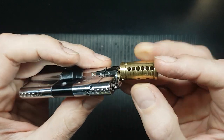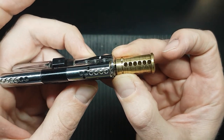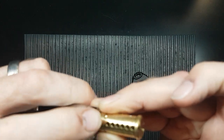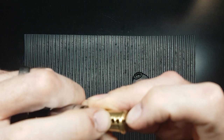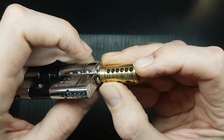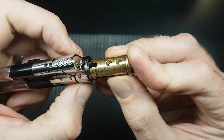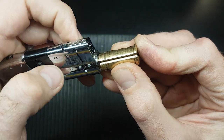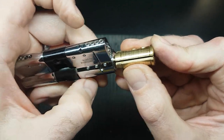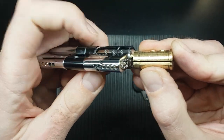What happens is if you were to pick it — which we're going to do in a minute — and you turn it to that first position, those three pins go into chamber six, chamber four, and chamber two, and they prevent it from moving. If you're able to get past those and keep on rotating the core, the bottom of the keyway comes into contact with these three, so you've got to get past those too. To open the lock we've got to rotate the plug 360 degrees.